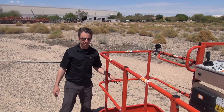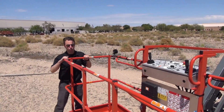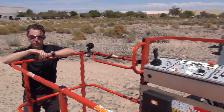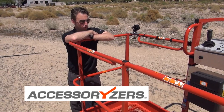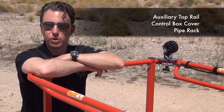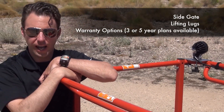This comes with a standard three-entry drop-bar entrance, and we do have an optional gate available. At the front we have optional platform work lights — a new option we're introducing on this machine, hardwired 12-volt LED lights. Other options include airline-to-platform, a flashing light at the base, a positive air shutoff valve for mining or applications with exposure to additional gases, and two weather packages: a cold weather start kit and an arctic package.